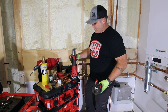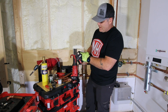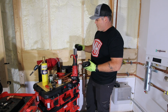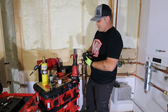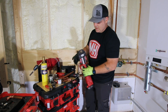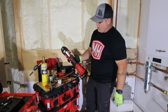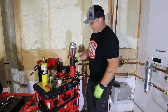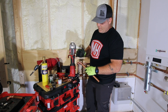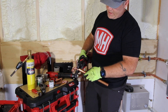I'm setting this aside to grab the tool — this is my M18 press tool. This is a three-quarter inch jaw set, a hexagonal jaw set, which is standard in North America for copper press fittings used in potable water and gas applications. To set up, simply insert the jaw into the end of the tool, depress the pin, make sure you've got power on your battery, and you're ready to go.